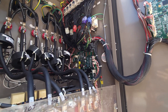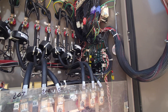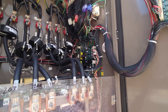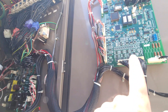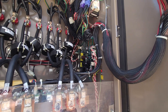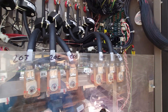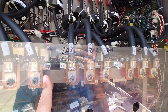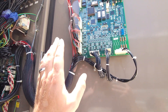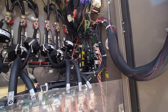Doing the print history didn't do as much as I was hoping. Our history only printed the ten points that we already could see through the display — we were hoping we'd get more history out of it, but we didn't. The customer has approved both the logic and the trigger board. Without a doubt, the trigger board is bad. Even though the logic board was sending the signal, the trigger board was not telling the IGBTs to actually fire. But we're not confident that the logic board and the harness and the trigger board don't have other underlying issues.